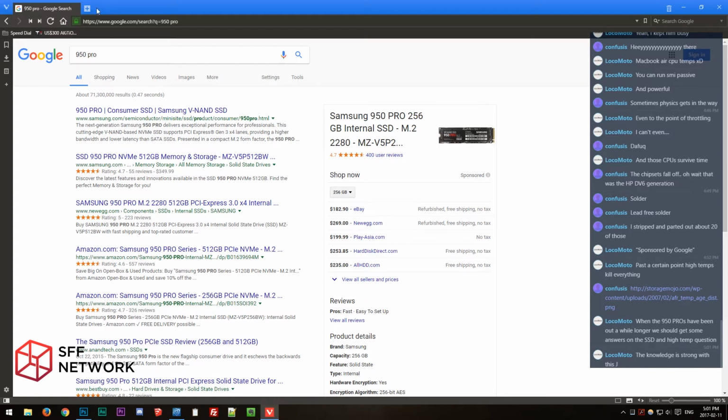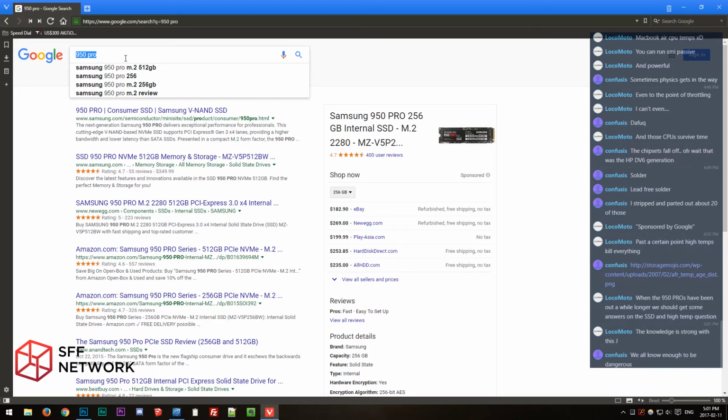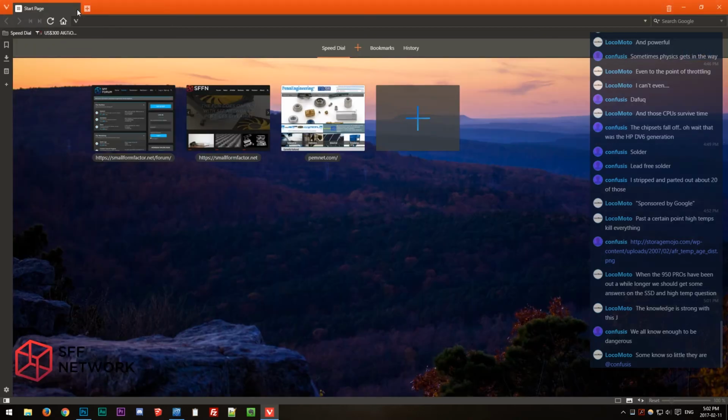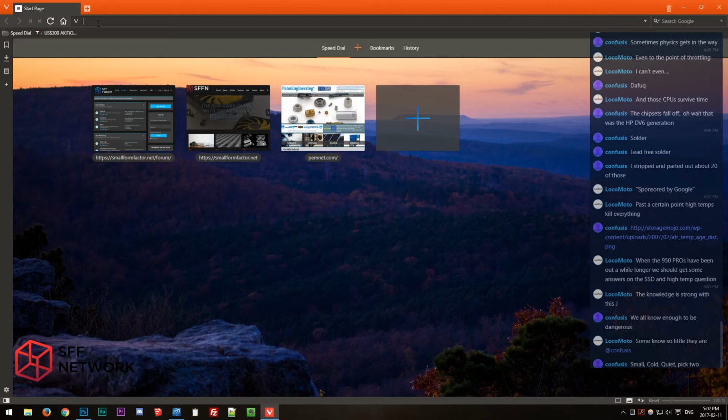Yeah, I've done a lot of reading. I don't really know as much depth as a lot of people, but temperature interests me because it's so annoying that so many people are so stuck on low temperature. It's not necessary. Running at ambient doesn't really get you much over running it at like 40, 50, 60 degrees, other than more noise because you have to have more cooling. In an ATX system you could easily have both low temps and low noise, but on SFF that becomes almost impossible. So you have to pick one or the other, and I always pick low noise. I just get very frustrated that so many people are still stuck on low temperatures when it's really not necessary.